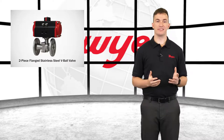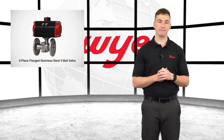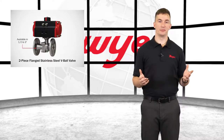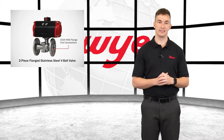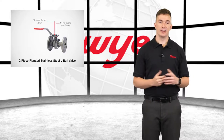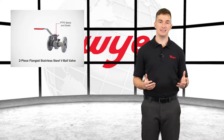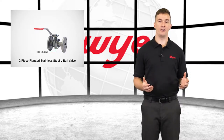The series WE07 is a V-port two-piece ball valve, which is designed for great flow rates with minimal pressure drop. Sizes are available from ½ inch to 3 inches with 150-pound ANSI flange end connections. The valves feature a blowout-proof stem for added safety, reinforced PTFE seats and seals for a longer life, and a 316 stainless steel ball for better performance.